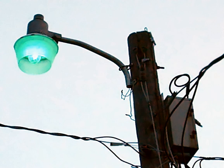As the main arc strikes and the gas heats up and increases in pressure, the light shifts into the visible range and the high gas pressure causes the mercury emission bands to broaden somewhat, producing a light that appears more nearly white to the human eye, although it is still not a continuous spectrum. Even at full intensity, the light from a mercury vapor lamp with no phosphors is distinctly bluish in color. The pressure in the quartz arc tube rises to approximately 1 atmosphere once the bulb has reached its working temperature.